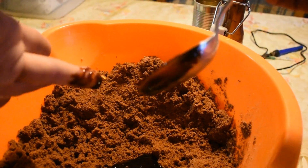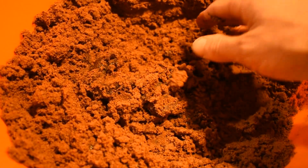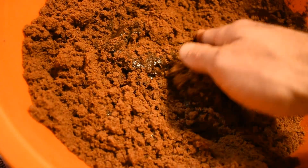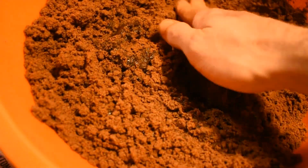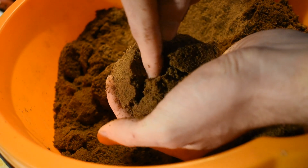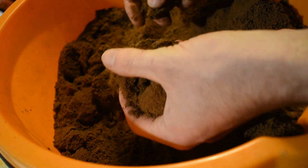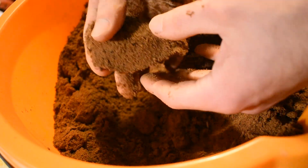After that, you need to slowly add water to get to the right consistency. There are two ways of determining whether you've got the right consistency. First, you roll the sand up into a ball and push your finger through it — it should split into three separate parts. Second, squeeze your hand with some and break it in half, and it should break away clean. If it's too sticky, you've added too much water, and if it's too dry, it will tend to crumble more.